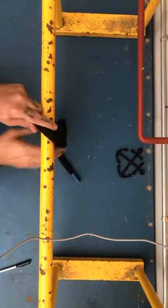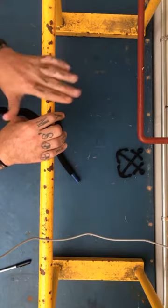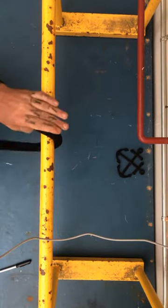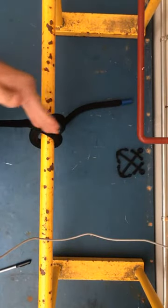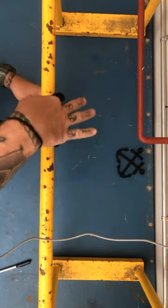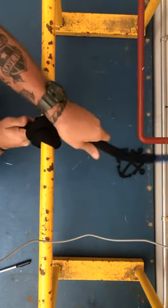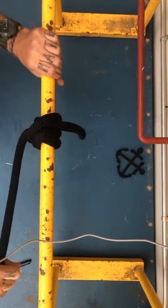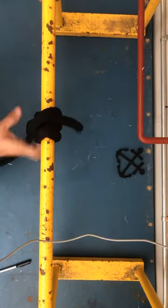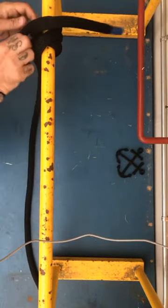For a rolling hitch — if this was a mooring line I wanted to make a stopper off of — I would do it this way. I'm going to come over once, like I would for a clove hitch, and then come over twice. Now I'm going to separate these two and bring them like that. My direction of pull will be this way. I can slide this, it will hold. I take tension off, slide it, and then it will hold.